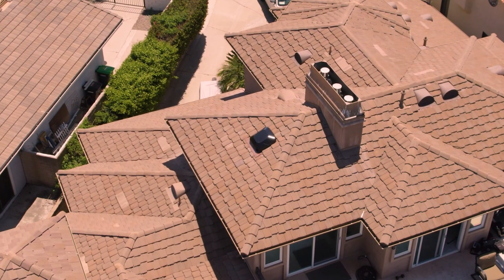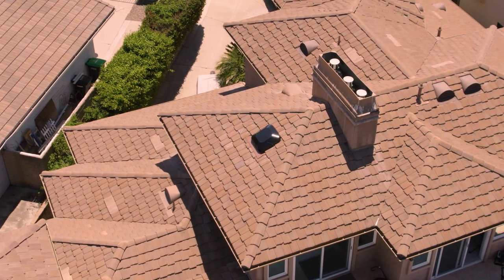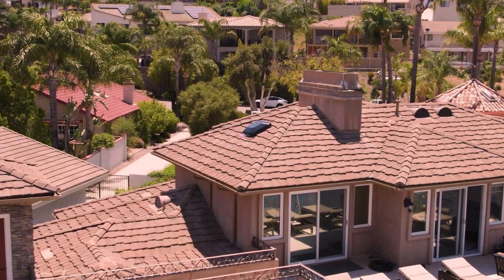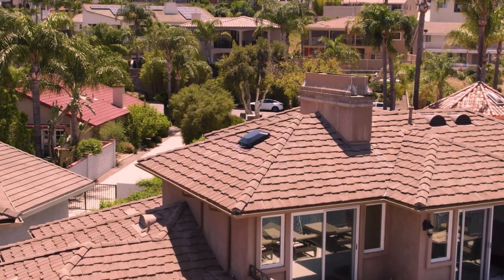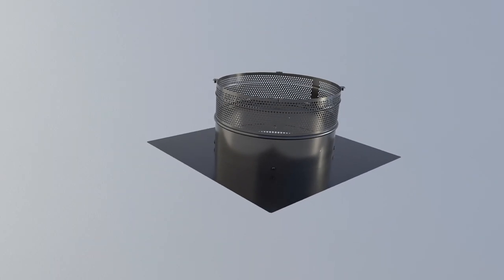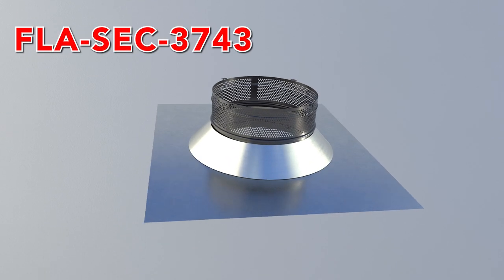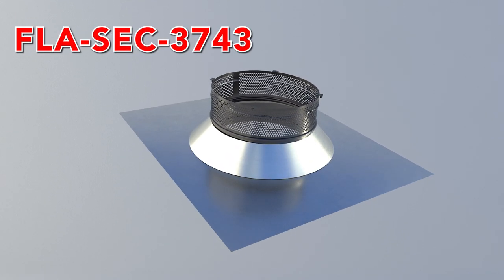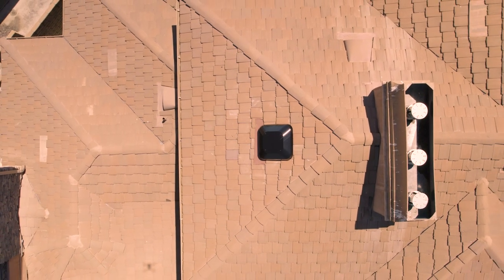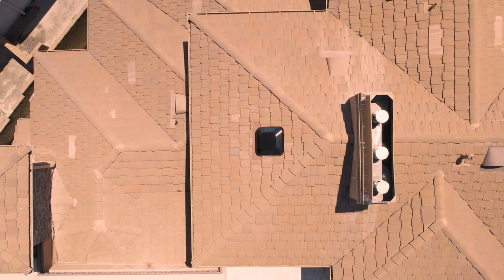The second generation AFR is designed to be the easiest roof mount attic fan that you can install on your home. For this installation we will be installing the AFR on a tile roof, using the included primary flashing as well as the QuietCool secondary flashing accessory. This flashing is sold separately and can be purchased anywhere QuietCool is sold — the part number is FLA-SEC3743. For installing the AFR on a shingle roof, please watch the video titled QuietCool AFR roof mount attic fan installation on shingle roofs.